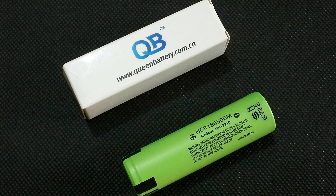The capacity test showed that NCR18650BM has a bit higher capacity than declared. The curves look excellent and I think it's underrated. It looks like this cell is capable of being discharged at higher than 3.64A. Maybe Panasonic limits it to keep the cycle life in an acceptable range.